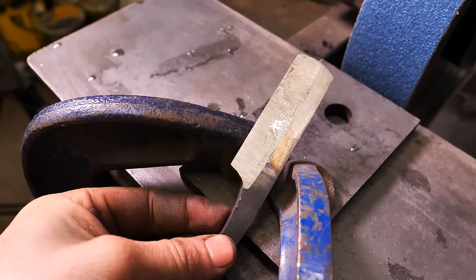That technique seemed to work pretty well. I've now got the edge still very thick, absolutely, but I've got the bevel roughed out. It's going to be pulled down further, the edge is going to go infinitesimally thin, but I don't want to take it that thin just yet. I'm going to go into the heat treat.